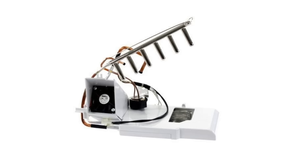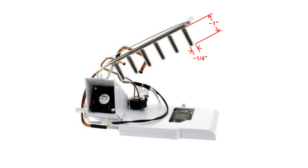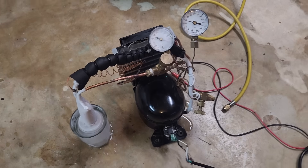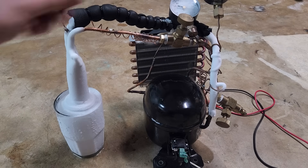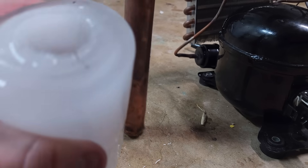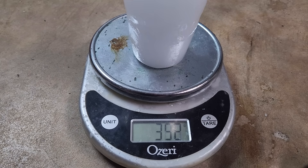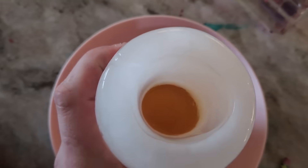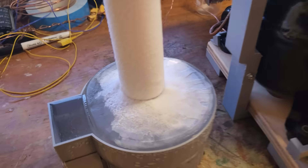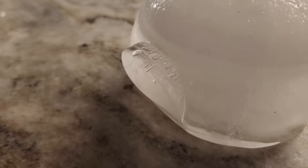The fingers in a countertop ice maker are usually about an inch long and a quarter inch in diameter. I wanted to scale this up, so I built a prototype using a one-inch diameter, ten-inch long pipe as the evaporator. It actually worked pretty well — it froze a glass of water in about an hour without any insulation, and in two hours it froze a one-liter container solid. I also tried to freeze an igloo in a 3D-printed mold, and it got most of the way there but didn't quite freeze the entrance because I wasn't using any insulation.